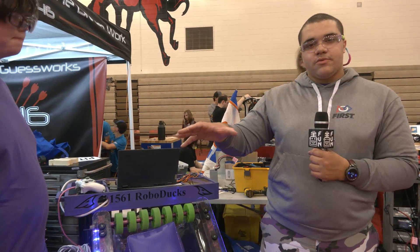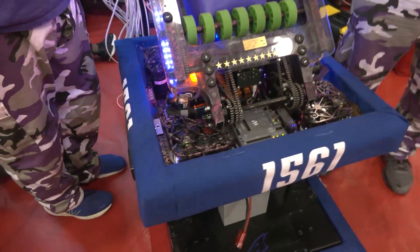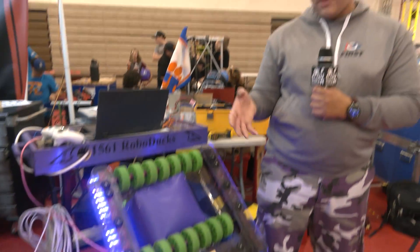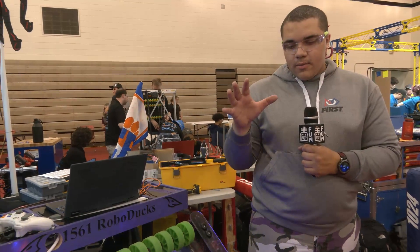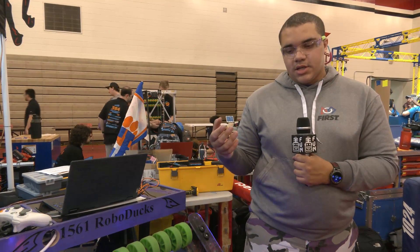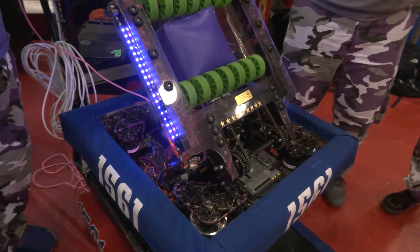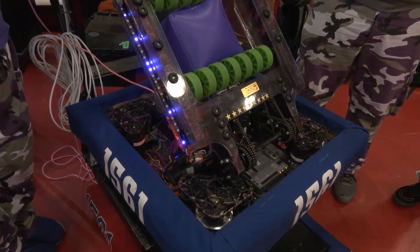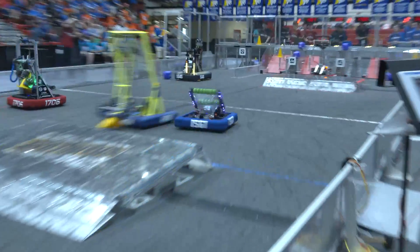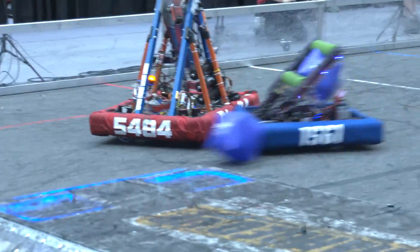At that competition, we noticed a big problem — our robot kept tipping over. If you went to Arkansas, you saw us fall over every other match, which was very sad, but we used that to learn. By the end of Arkansas we turned more into a defense bot. It didn't work out too well, but we learned. We were week one and week two competitions, so we had three total days before the next competition to change our robot completely. We kept the exact same frame, ripped off the tower, and built pretty much exactly what we have now in three days. The motors used to drive the arm were put on the arm itself, which weighed a lot — it didn't work really well and it broke after every match. However, we did do really well at that competition with that terrible version of this robot.